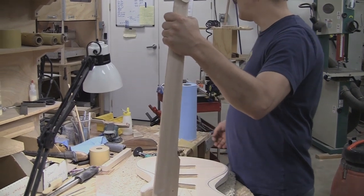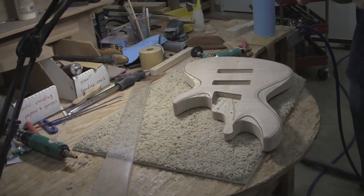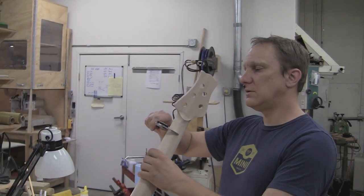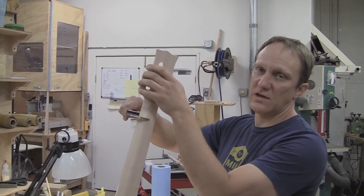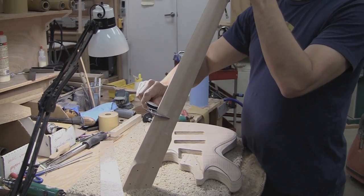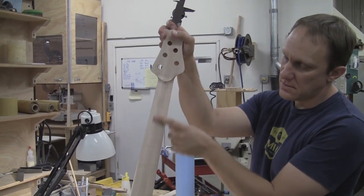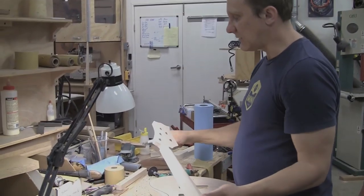I use a caliper to measure the thickness. I don't target thicknesses when I start carving, so this one currently measures 843 thousandths and I want it to finish at about 810 when it's done with fine sanding. Then I go about 100 thousandths more as I go up the neck. This one's about 910 right now, so I have to take more meat off here, blend it up, then blend out to the edges and make it comfortable.